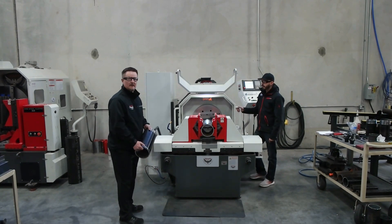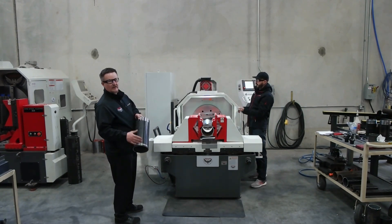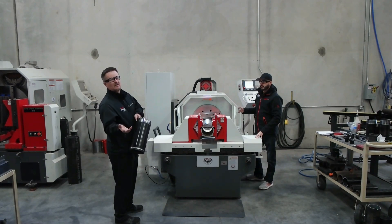I am going to leave it up to Jaime. He is going to run this part — cut groove, we will change tooling, then we will thread. Then we are going to pull this part out and change the tooling, show you how to change the tooling. We will do 4 inch NPT and probably 2 inch NPT.